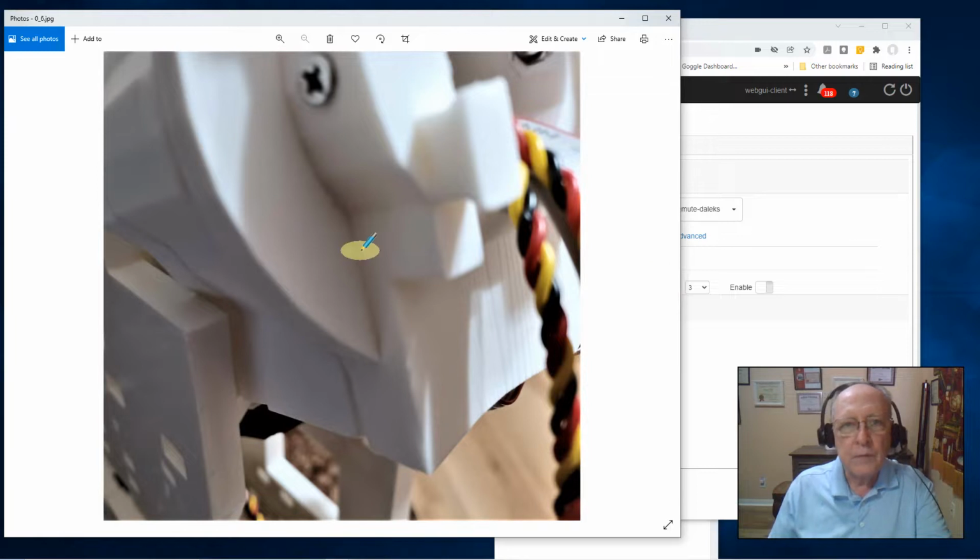This picture is an after-the-fact picture, let me put it that way. I needed a picture to demonstrate something for you, but I didn't take it before the assembly. So you can see here, this is the pivot assembly already mounted into the torso. But I've used the Omniplate and pulled it out where you could see the bottom edge. The reason I've done that is I want to demonstrate what I used as a zero reference point during my electrical alignment.